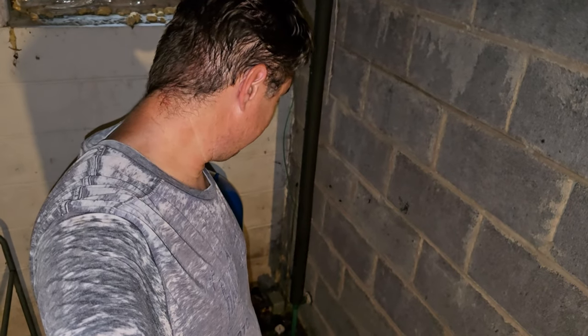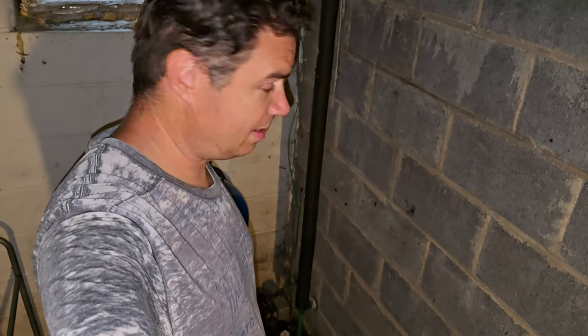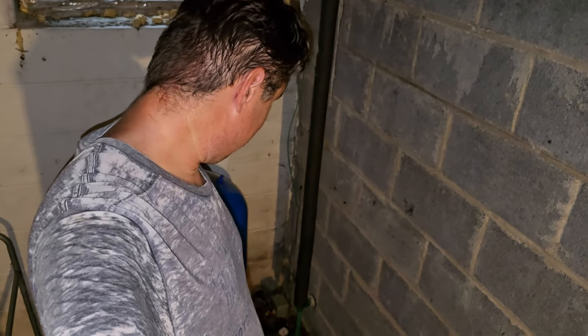I think we got it fixed here. It took five minutes and 20 seconds to drain down with that sink running. More than that because I walked across the basement. Then it took a minute and 10 seconds to fill back up. That's much better than about 30 seconds to drain and 10 seconds to fill up. So hopefully we'll see some improvement on our power bill with the pump not running all the time. Hopefully we don't burn out our pump now. And now we're not drinking bladder water — it's good.